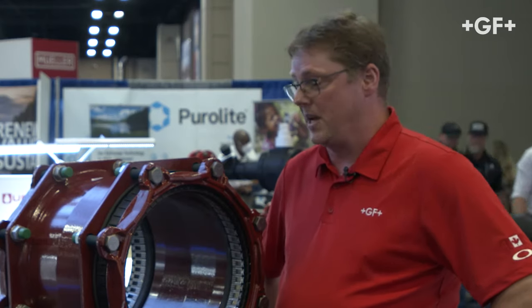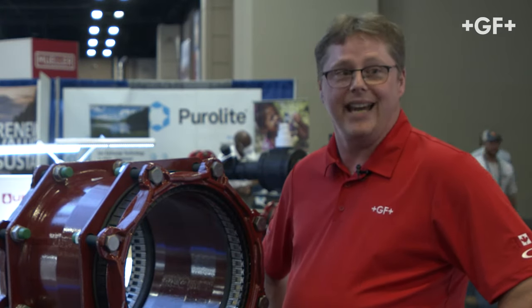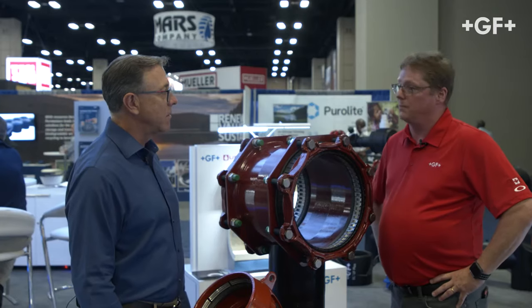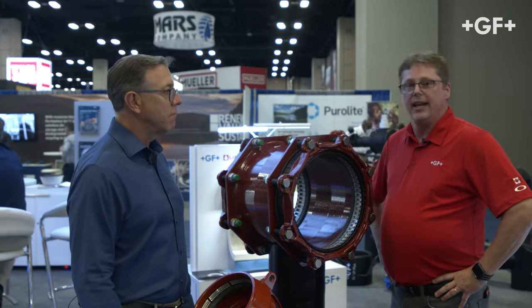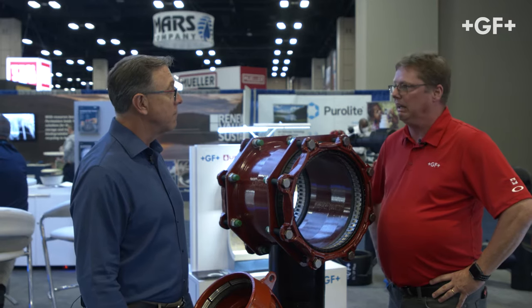Well, Brian, the best part about this system is that it can connect to any pipe material. It doesn't matter what the pipe material, whether it's ductile iron, cast iron, stainless steel, AC, PVC, HDPE, it doesn't matter. We also have 16 degrees of deflection, which is the largest currently in the market today. Is that 8 degrees on either side? That is correct. 8 degrees on each side.